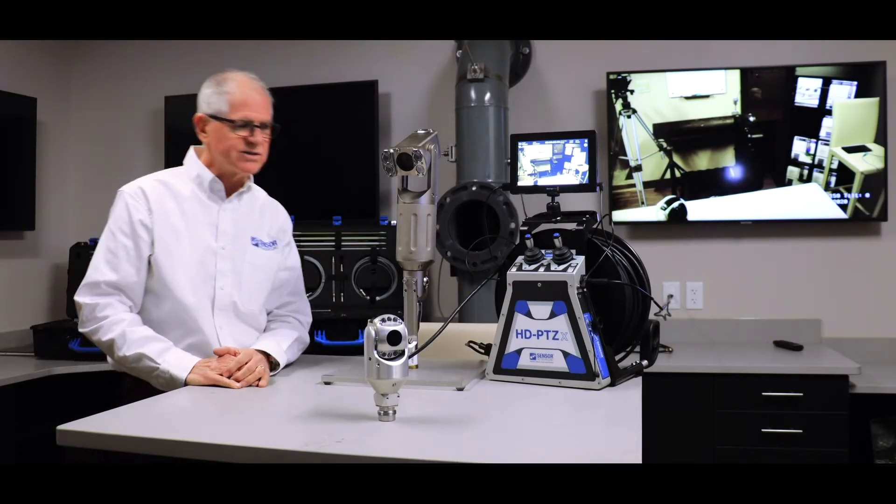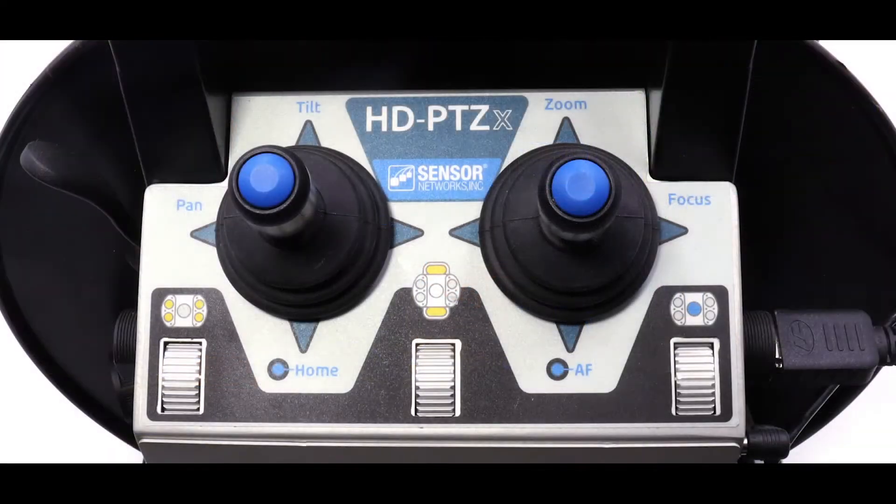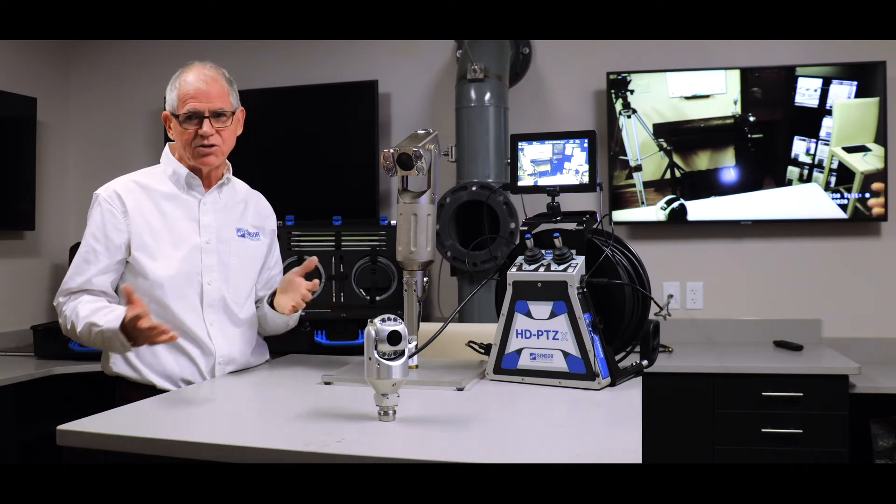The reel is comprised of a control panel used to control pan and tilt with this joystick, and also a home function. A second joystick controls some special functions as well as zoom controls and focus, either manual or automatic. There are three dials in the front: the left dial controls the onboard LED illumination at 2000 lumens; the center dial controls auxiliary lights either on the top, bottom, or both; and the third dial helps you adjust contrast to suit your needs depending on whether you're looking at something light, dark, or a mix.